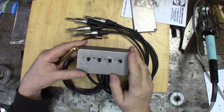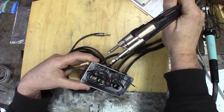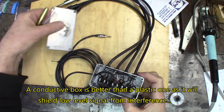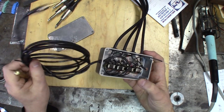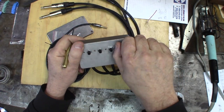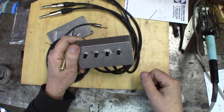This is the final result, or just about. The four potentiometers are inside, the four inputs that will go into my receivers. The ground goes to the body of the case. The insulating resistors are in. The output goes to the camera itself. And that's about it — final result, not too bad. Whatever channel I use, I just put up the potentiometer, dose the amount of sound I want, and that's going to be pretty clean.